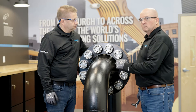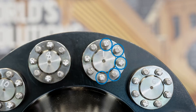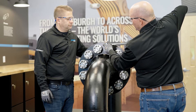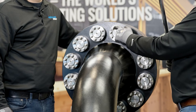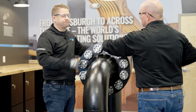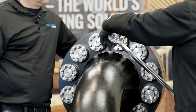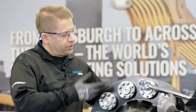So we've made our two passes — one at 50%, one at 100% — in our cross pattern. Now we will begin in a circular pattern. We'll start again right back at the 12 o'clock mark. As you can see, that jack bolt is a little bit loose — it's common. Once you go around to the starting point, it will actually be loose. All the other jack bolts are now starting to be loaded, because we're adding tension into the stud as we're tightening.